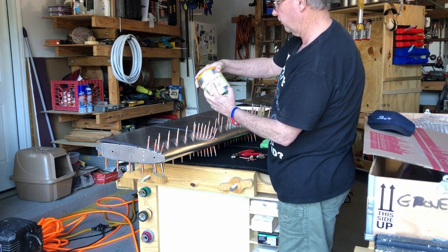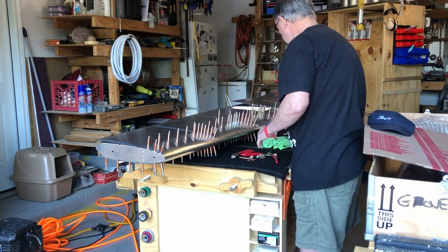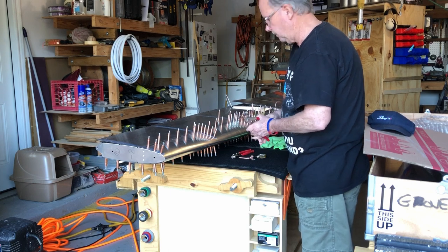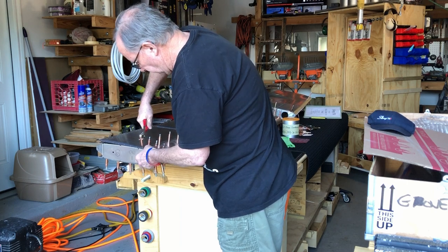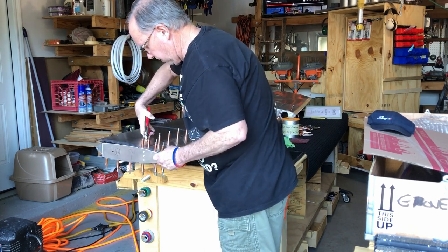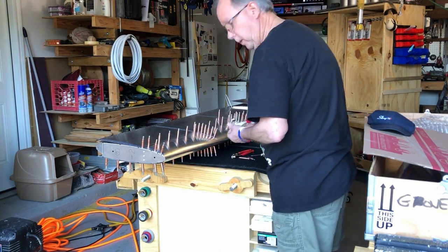3.2 10 millimeter countersunk rivets, multi-grip, part number 989. We'll be going into these probably in the next video, which will come up this afternoon. But I just want to show you, talk to you about the Clecoing, because this is important. And you do really have to go every other one, or at least every one. In some places, I recommend doing every one, like here, and here, and here, and here, just to keep everything well aligned.